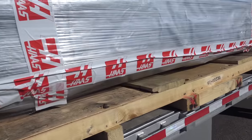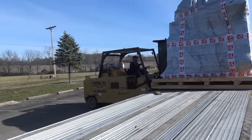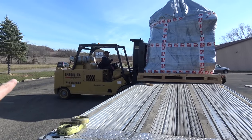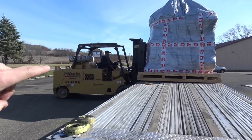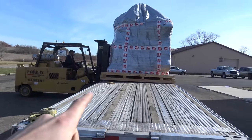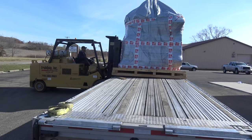There, we can see it. Nope. You're right. So this is one of those forklifts where the back end, and I think the wheels too, will go all the way back for counterweight. It gives you a lot more lifting capability, because the limitations of these forklifts are not the hydraulics or their sheer lifting ability, it's the balance. You got this load here on the end, so adding counterweight lets you lift more. I don't think we have to do that today.